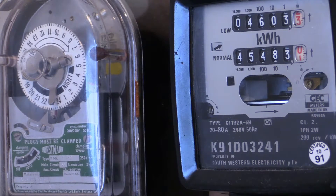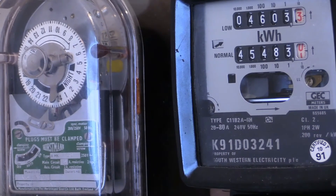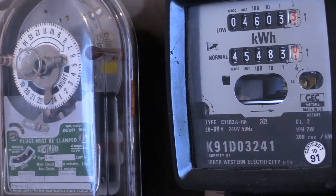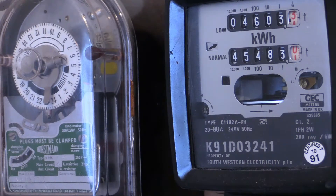We should leave it like that until we get a roll over. We'll leave this going until that time switch comes around and turns off, and we can watch the electric meter stop and go back down to the normal tariff. It's currently on the low tariff which is the upper readout — if you watch that it is slowly registering up. Well, it's registering up at quite a rate because we've got somewhere between 75 and 80 amps in that electric meter.